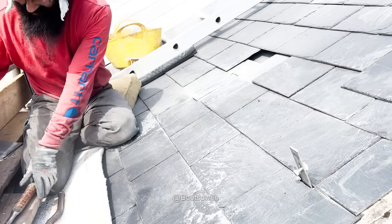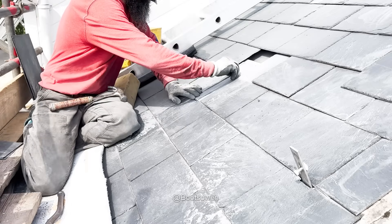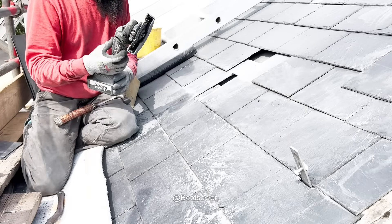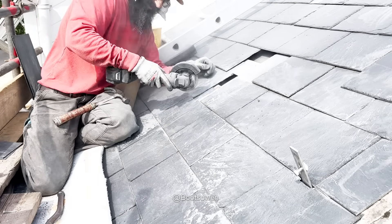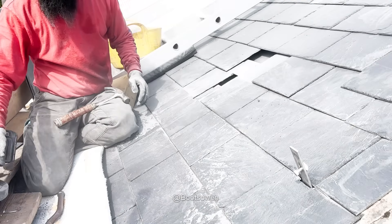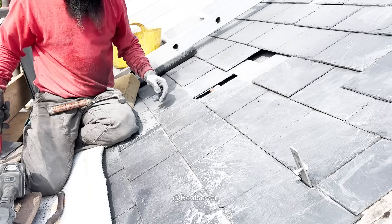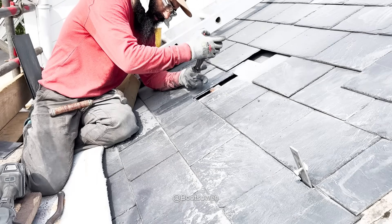We'll have a two-and-a-half-inch overlap of lead, and then another slate on that. Just down on the right-hand side there's very little of the bracket sticking up, but you can just make out a little bit of lead sticking out in the bottom right corner. It's flashed above and below. The top one is easy to cut out; the bottom one's trickier because you don't want to wreck the slate. I tried to be tidy because it's my roof. Pop it out — they're quite brittle — and then this bit needs to be nibbled out, so I use the pincers. When you're three stories up you don't keep going up and down every time you need a tool.